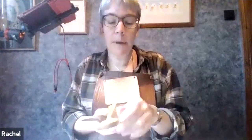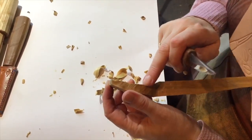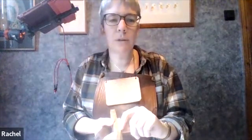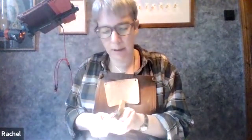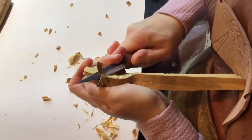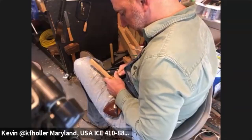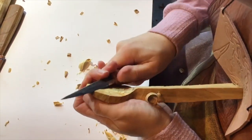So after I've gone around the sides, I'm going to do the top face next. And if you have a look there, you can see that this is my pretty poor axe work. So I want to get right underneath there, and at this point, I am pretty much establishing my finished crank, mostly in the bowl. So I want to dig as deep as possible to accentuate that crank with these cuts. I'm not coming right across the whole of the bowl, I'm just concentrating on the edge. I'm coming down. This is where you're doing the part that I call the rim now. But the bowl shape is still wonky, right? That's right. It's near, but it's not final. But this is getting underneath the axe marks, but also predominantly establishing how the bowl is going to look.